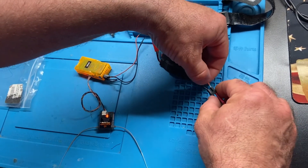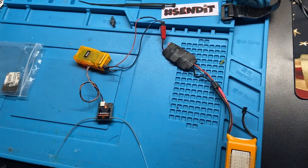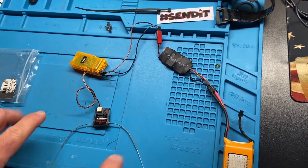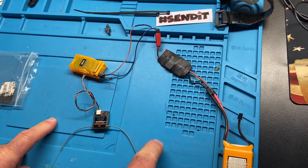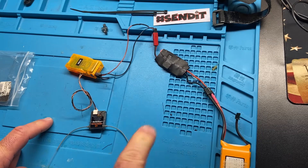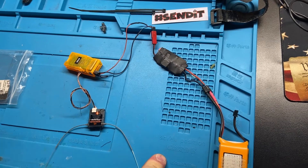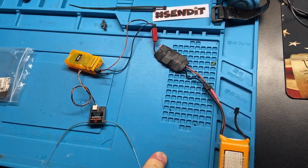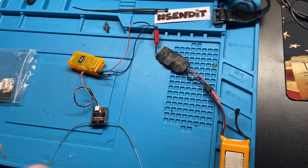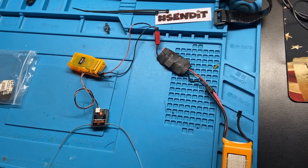You're going to hook it up, and you'll see that this is already in bind mode right off the bat. All you have to do on your transmitter is set up your quad as a new quad, shut the transmitter off. I assume you have a button for bind or a switch, so what you do is flip and hold the switch, or push and hold the button, and turn your device on.